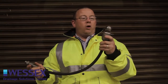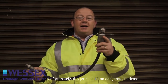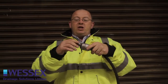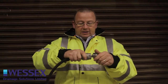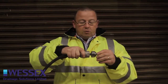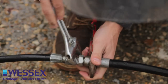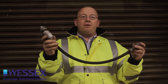The last one I've got here is called a Warthog. This is an American design. We were demoed this about 18 months ago and this jet has got a very aggressive jet that comes out of there. It spins and will remove medium to heavy roots and also very heavy scale. It is a very different sort of jet because the angle of the jets are set precisely to a certain degree to get right under the scale or cut the roots. It is actually dampened as well so it doesn't move as quick as the other two I've just shown you, but it's a very impressive jet which we'll see later on.